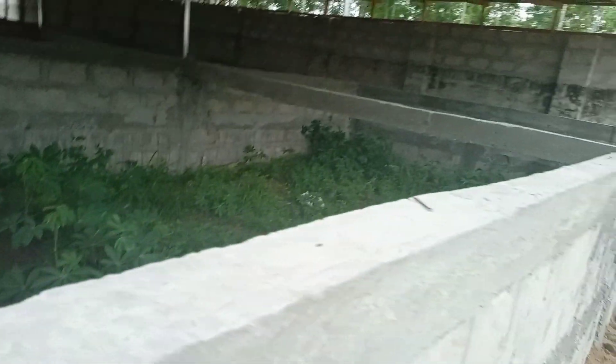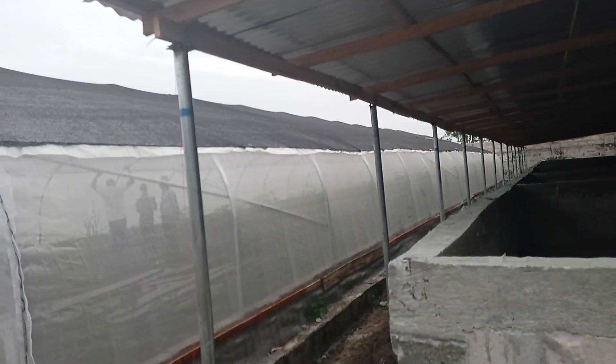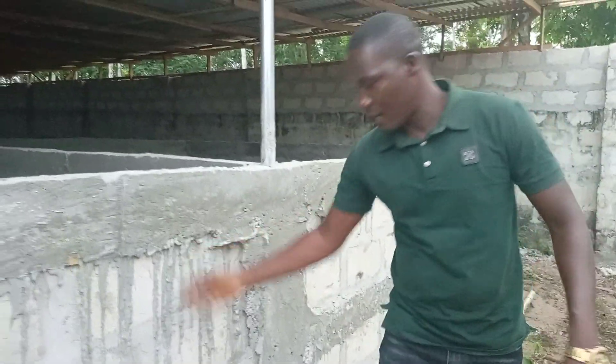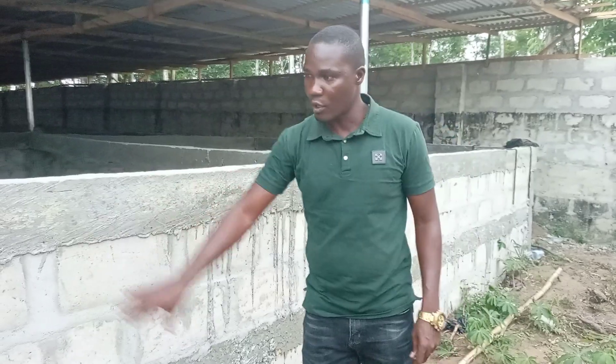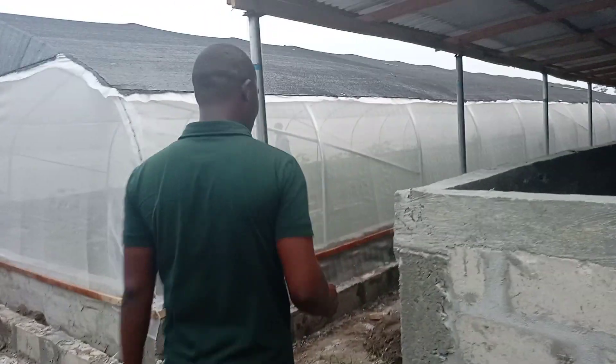You can see the pillar work we've done here — one pillar, a center pillar, and another pillar there. We braced it here and here again, which gives solidity. We have four divisions crossing with solid casting. We're going to plaster it all together, so you won't know which part is plastered. We did the same thing here too in order to strengthen it.